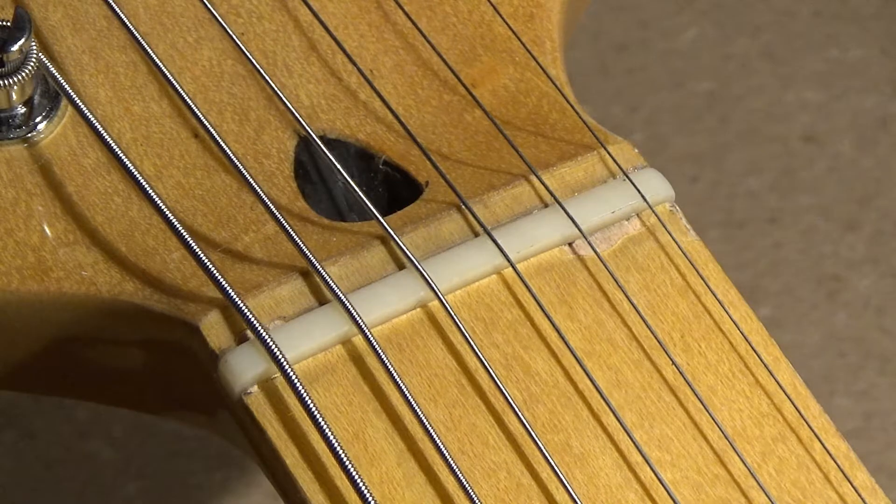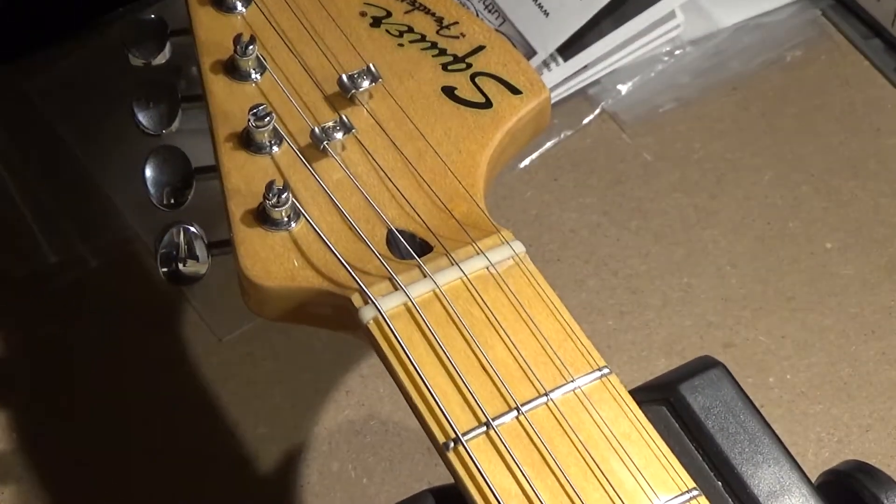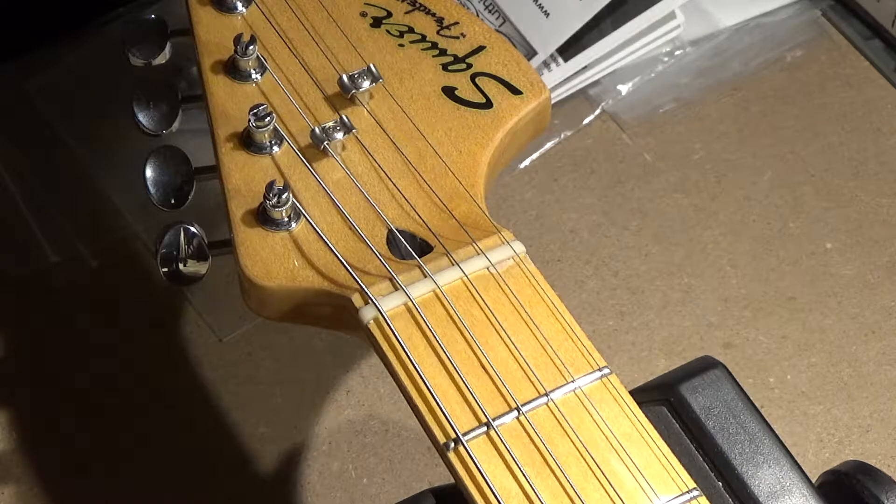The way I'm going to make this nut, as I'll also show you in the next videos, is I'm going to use a nut shaping jig that I bought a couple of months back from a company based in the UK called GMC Luthier Tools. That jig is just a lifesaver because it takes out all the measuring and headaches — it's really simple to set up and you can gauge the nut slot depth and the radius using this jig.